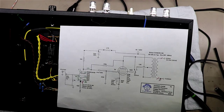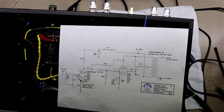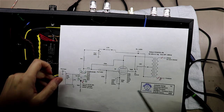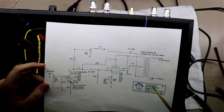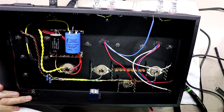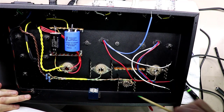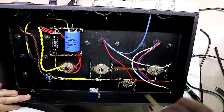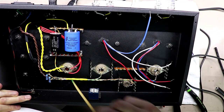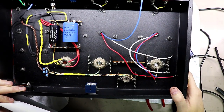So, as it comes to wiring up your amplifier, it doesn't really matter where you start, as long as you start somewhere, work consistently, and mark your way off as you go. On the pot, I don't know if you can see it or not, but I made a decision to turn my pot sideways so that the pins are facing over here, because I'm going to bring my input connections around over here and avoid coming through any of the high voltage sections.